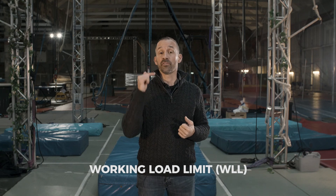There are some things you should bear in mind. You may have created the perfect rigging point for your purpose, but are you sure it won't end up being used by more people than intended all at once? If you've installed the rigging point in a downstairs ceiling and you end up holding a party upstairs while someone is practicing, it's very likely you can exceed the safe working load of that particular beam. Remember that neither the rigger nor the engineer will take into account factors such as whether there's clearance to perform the tricks without damaging people or items — those aspects are definitely down to you.